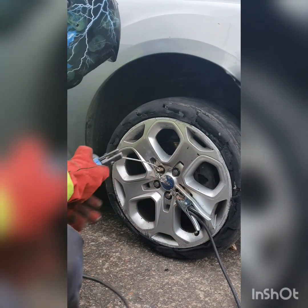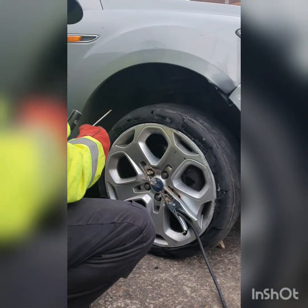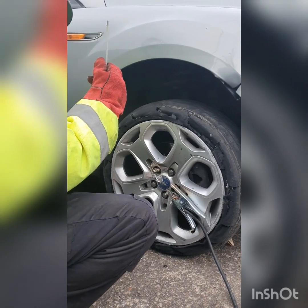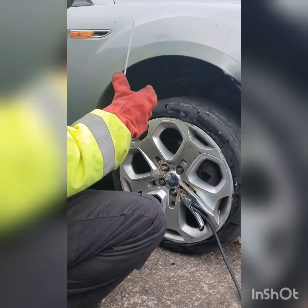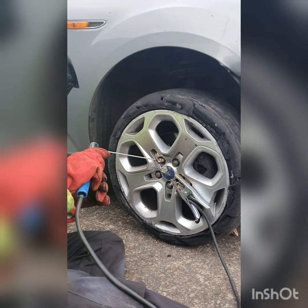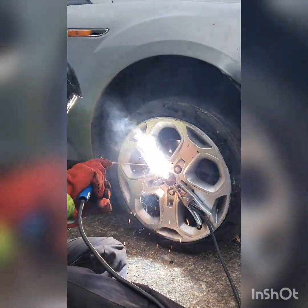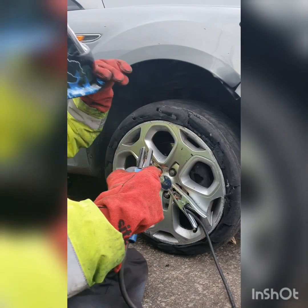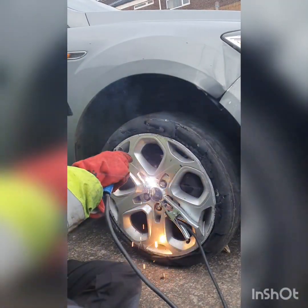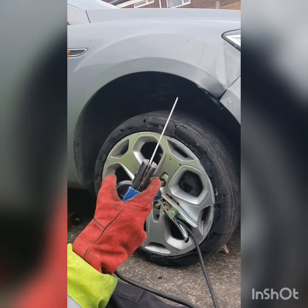This is weld stick — it's very common — where the actual welding rod sticks to the material that you're trying to weld. It can be a combination of things: you might not have quite the right amps set for the particular rod you're using. What you have to do initially when you first start is kiss it — just kissing it, that's the best way — as if you were striking a match. Then as soon as it's within that instant of a second, you just start welding straight away. I taped around the actual nut itself with some aluminium foil tape, just to protect the rim a little bit.